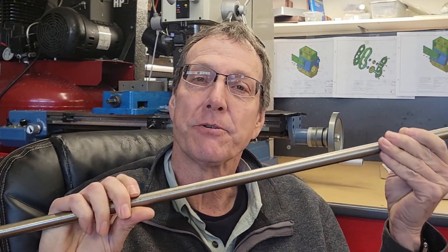In the next series of videos we're going to be tackling the camshaft. We're going to be taking this piece of drill rod and reducing it to one of the most challenging parts in our engine build. In the first part we will create our camshaft blank, which will have all of the features on the camshaft with the exception of cutting the lobes themselves. In the next video we'll make the lathe fixture required to cut those lobes, and maybe if we have time, to even cut them. In the final installment of the camshaft series we will cut the lobes using a CNC machine. The drawing for the camshaft is available free on my website — link below. It's located in the camshaft assembly zip file.